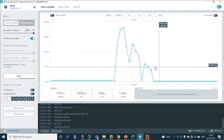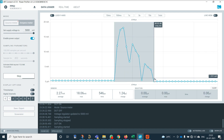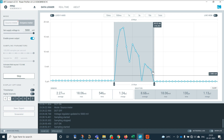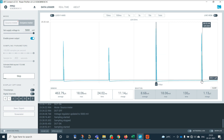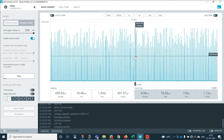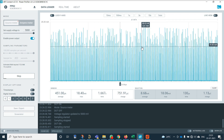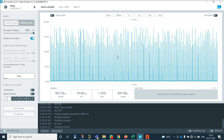If you want to know for how long a peak lasts, you can press Shift and left-click, then drag to the end — you will see that for 130 microseconds this DC-DC converter is consuming current, then after certain milliseconds it consumes some current again in order to keep the output at 3.3V under no-load condition. When you zoom in, the real-time view stops, which allows you to do analysis. If you want to go back to live view, you can press the live view button.